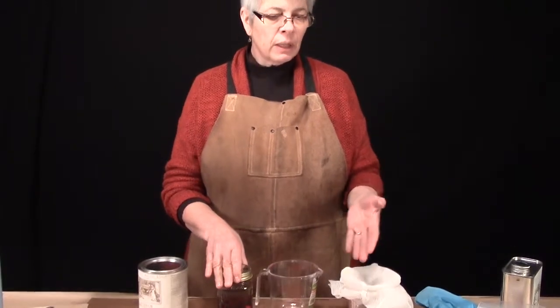For instance, at this point you probably have a sealer consistency or a low luster consistency out of medium, were you to dilute that with anywhere from 20 to 30% solvent. So that's how you would try to revive it. Sometimes it's doable, other times it's not. Sometimes you just have to replace the material.